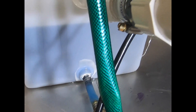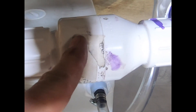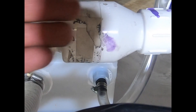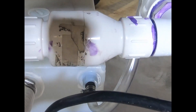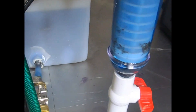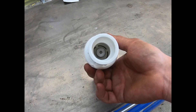At the heart of this system is this one-way valve — I recorded a separate video segment about it which will follow. This allows flow in one direction but doesn't allow flow backwards, so when draining the pan from above it can't flow back through the pump. It has to go through this pipe and through this water filter.